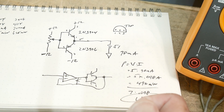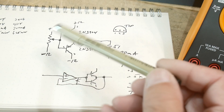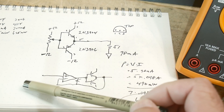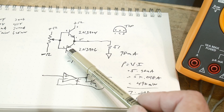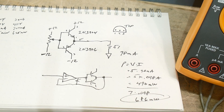Make sure you adhere to the wattage rating of the part, and use the 2N3904 and 2N3906 as complementary pairs — they work very nicely together. I believe the 2N2222 and 2N2907 are also complementary, but I'm not 100% certain on that. That's the chip of the day!